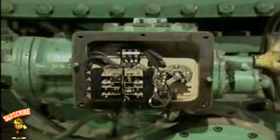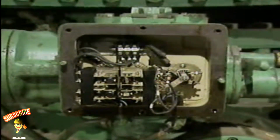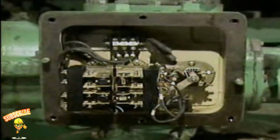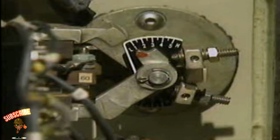Enclosed in the body of many electric motor operators is a torque switch, a limit switch, or both, to ensure that the valve is positioned properly without being damaged. This is a torque switch. Basically, torque is a turning or twisting force. A torque switch cuts off electric current when the amount of turning force caused by the motor reaches a preset limit.